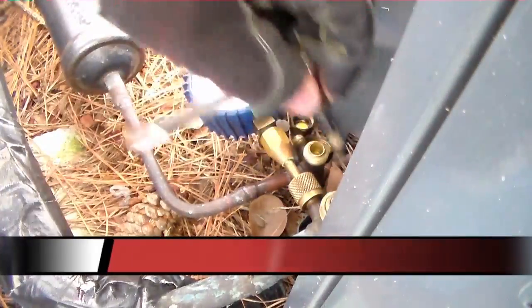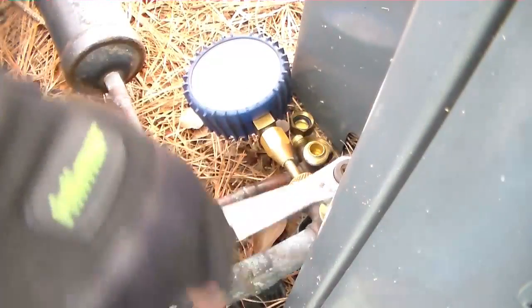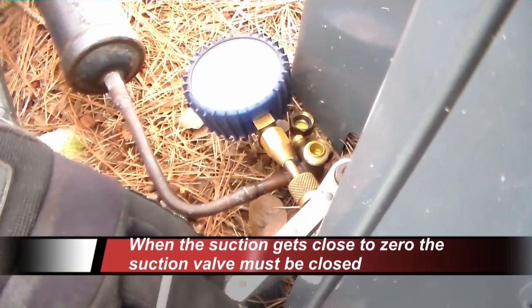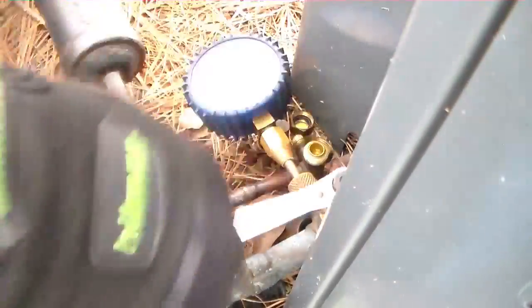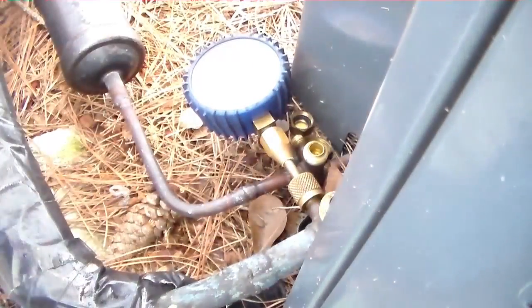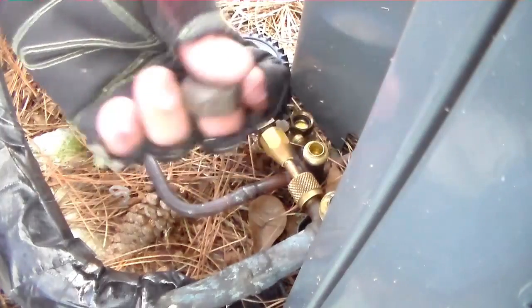Leaky coil and some valves that are leaking as well, looks like. Seal those up too. Looks like some nylog on them. Good thing is the service valve leak is not uncommon, so you can usually seal them off. These caps have gaskets in them. We'll reseal those.